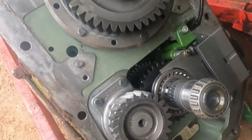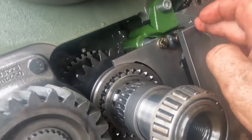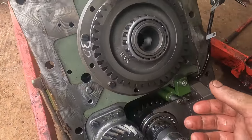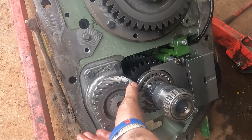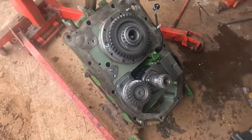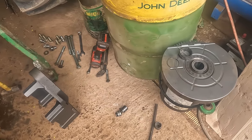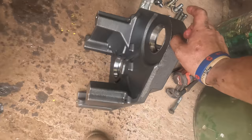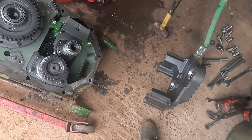That off now. I think what is next is to take this off, the magnet, and then I think the whole lot comes out in one go. It might be rather heavy. That was alright. That's your PTO brake there. The oil will come in there and push that pad out against that. But at the moment, I can't see any missing teeth, which is good for my wallet, because like I said a minute ago, that one's 1900 quid, and that was three years ago, so that's probably like £2,300-ish. I don't know whether that bearing there, well, we'll either need to get this machined or get a new one, I don't know, but I'll try and get that out now.